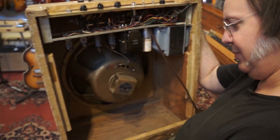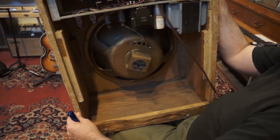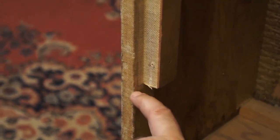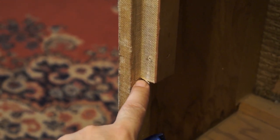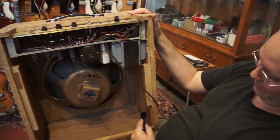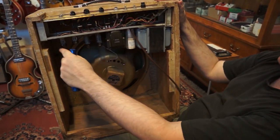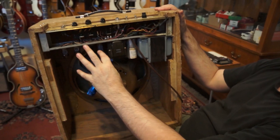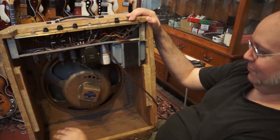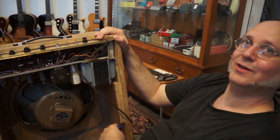Based on how weathered this is and how stuff is spilled on it, my guess is maybe the original back stopped here — oh yeah, because it is lighter, white and dark, right up to that point. So it might be a piece of plywood. My guess is they ported it here, so it would have had a big port down here and is probably solid from here to here. Some of them would have a vent hole by the tubes so the tubes could vent — if this was built on anything like a Fender, it would have an oval or square vent hole so the tubes could get some air.